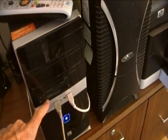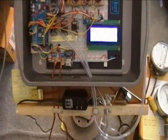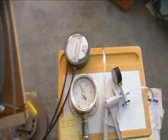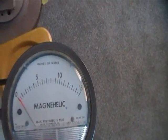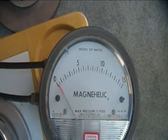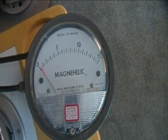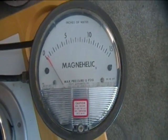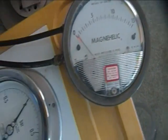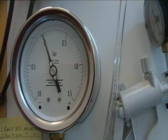Right now I'm running it from the USB port on the computer. This is my external power supply. And over here are my two gauges. This is a bi-directional gauge, so it'll go either vacuum or pressure. I've calibrated that against a U-tube manometer I got from L Power Labs a couple of years ago. And here is a plus and minus one bar gauge.